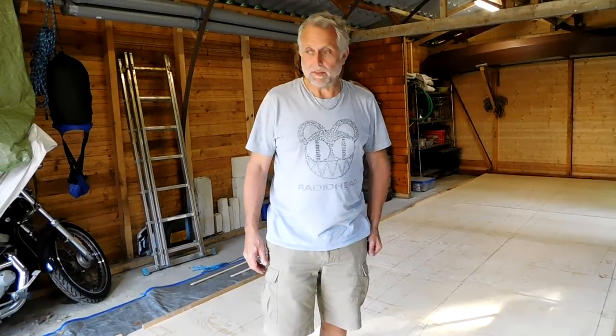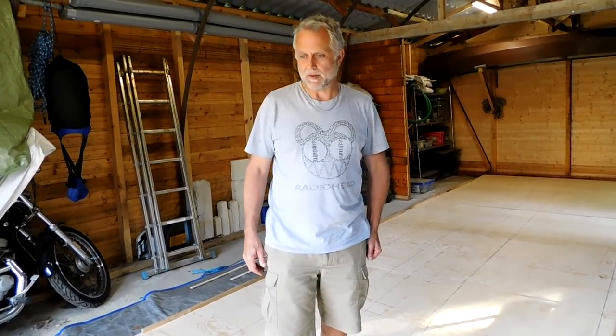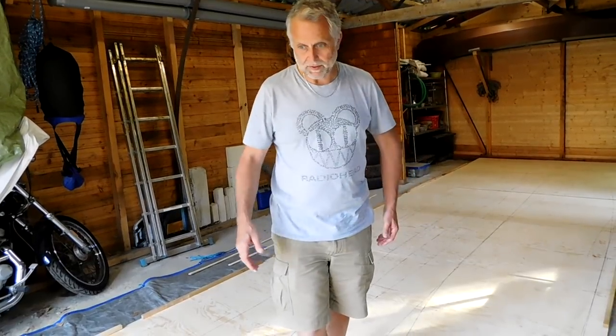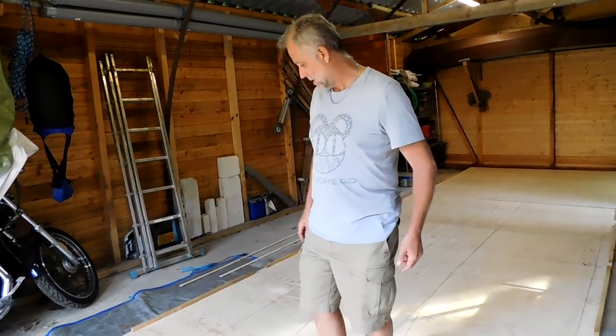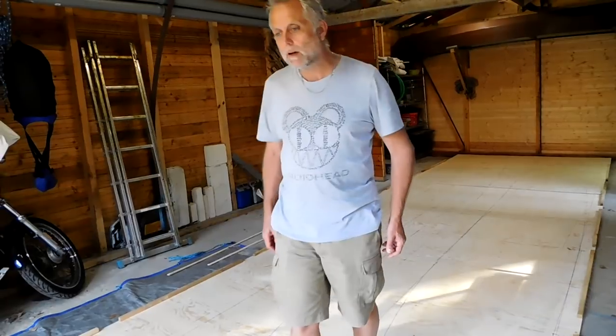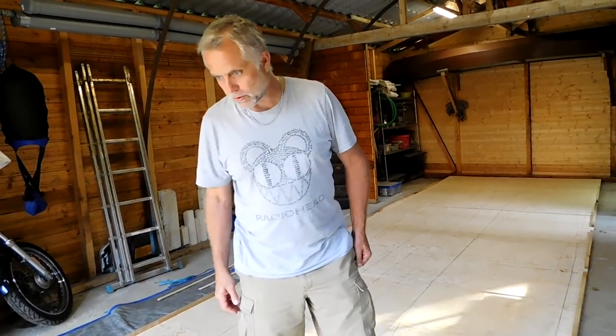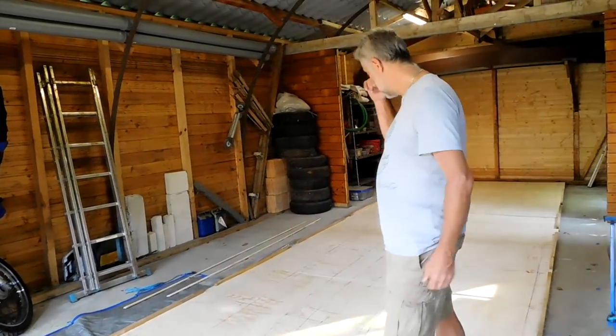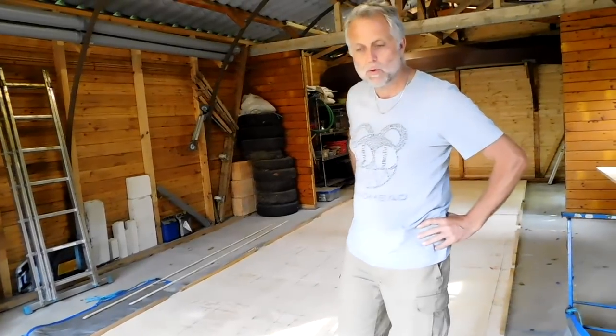Yeah, so here we are. So we've done the basic lofting. Elizabeth and I drew some more views of the boat, the plan views of the boat, this morning. Widths drawn out, the chine, the shear, and the top of the coach roof and cockpit coamings. So that's all done. So now we've got all the lines drawn out that we need to build the boat,